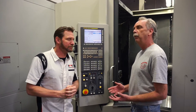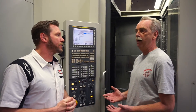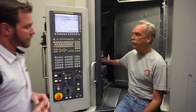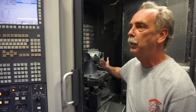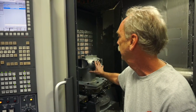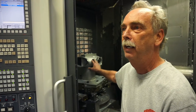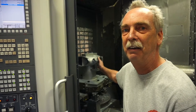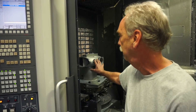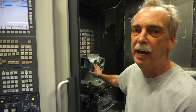One of the things that Allied really does well at is programming on multiple axis, multiple pallet, high speed, horizontal machining center. This particular part we're manufacturing used to require six different setups — we do it all in one setup now. Every time a part is handled by an operator, it introduces an opportunity for human error. This part is now completely machined in one operation, which adds a tremendous amount of accuracy.